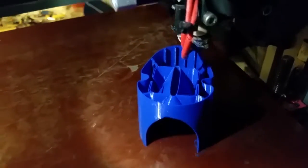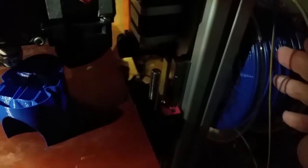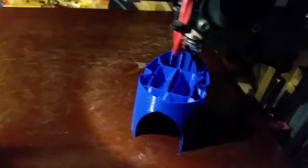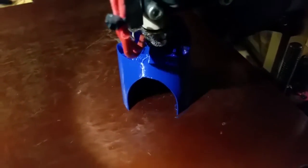So, my opinion, point number one: temperature of extrusion, temperature on the nozzle. Use the maximum temperature you can with the filament, because each filament has a different maximum temperature. I use many filaments here, from different manufacturers, and I know, for example, with this filament I can print at 220 or 230 degrees Celsius. But with this filament, natural PLA, I can print only 190. At 200 it is just a non-printable material. So find the maximum temperature for the filament you want to use.